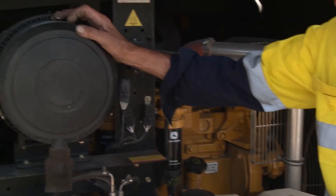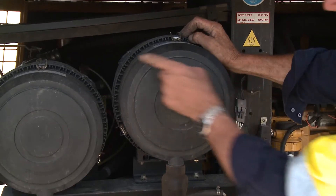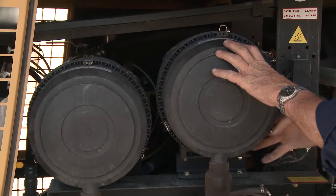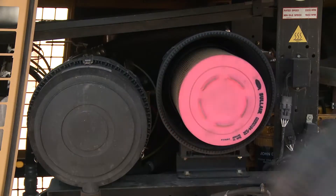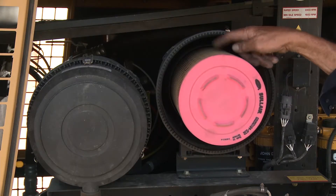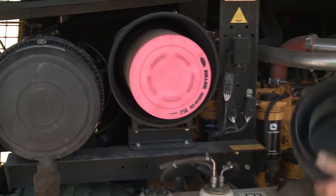Underneath this hatch are the air cleaners, which filter the air going into the turbo and into the naturally aspirated engine. To check the filters there are three clips on the filter housings which expose the filter. From a visual aspect you can check the pleats in the filters to see if they are congested. It also doesn't hurt to give the housing a wipe out with a piece of rag each time you take it off, to ensure there's no excessive dust in the base when you reinstall it.